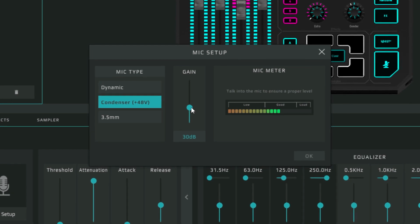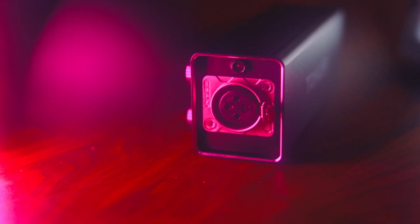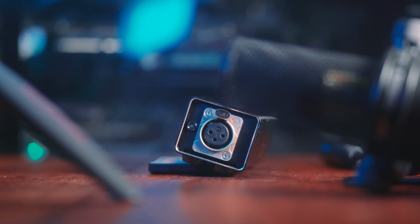These mic activators work by using the phantom power of your preamp. So you take your preamp, plug it into one of these mic activators, and then that outputs a signal which is actually 20 to 25 decibels louder than usual without adding in any additional hiss or hum or horrible background noise, which could ruin the quality of your audio.